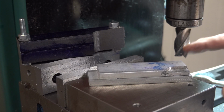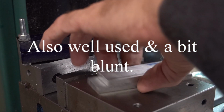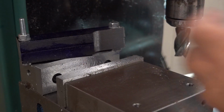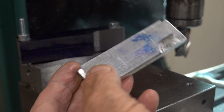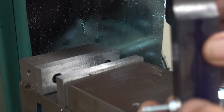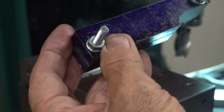That was hard work, that 3/4, probably a bit big for my milling machine. I could feel the machine vibrating, and I was climb cutting, unfortunately. Just to show, that's the packings I used underneath it, sacrificial, something that's scrap, that it doesn't matter if it ruins it, and it has, it sacrificed it. So there you go. That's the shape, and I've measured it, everything's correct. So we're on form for what we're doing.